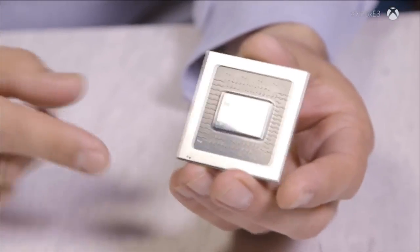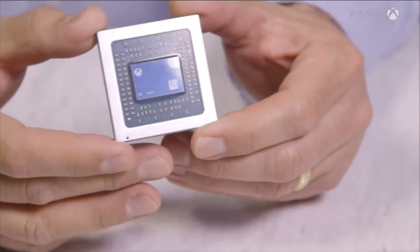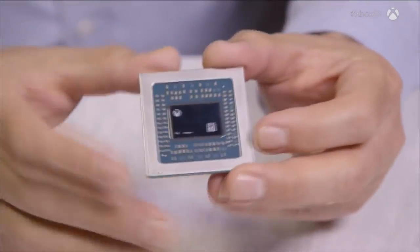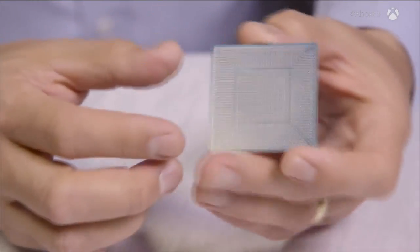There are 15,000 signals coming in and out — connections for signals coming in and out of this piece of silicon. The piece of silicon has all the circuitry, but we can't make a device out of that by itself. We have to break those signals out, provide power and clocking. The silicon forms the heart of the product, but to make it a product takes a lot of other pieces.